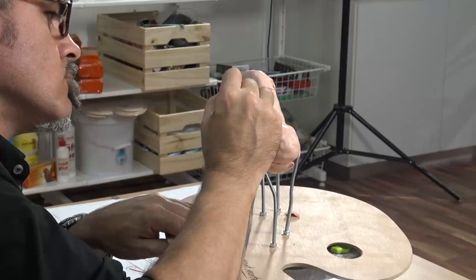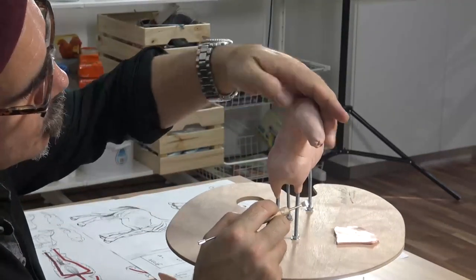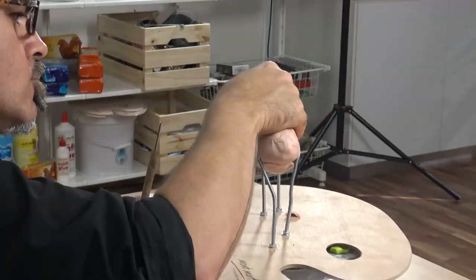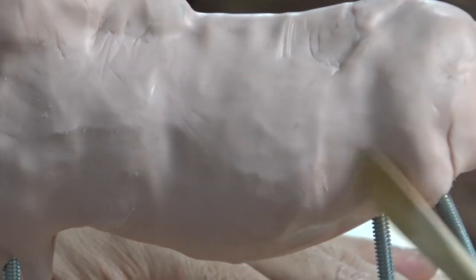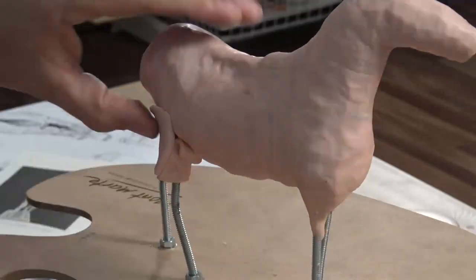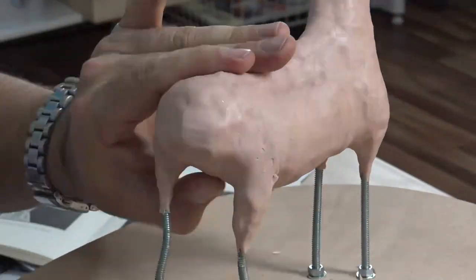The reason for this is that the air heats up and cannot escape, and it fluctuates in temperature. Aluminium is very heat stable and cools quickly. Clay requires a smooth cooling transition to avoid expansion and or contraction. This expansion and contraction is what causes cracks.